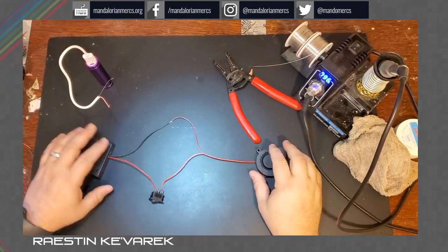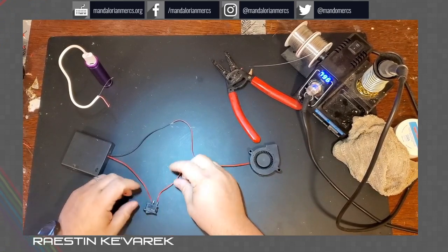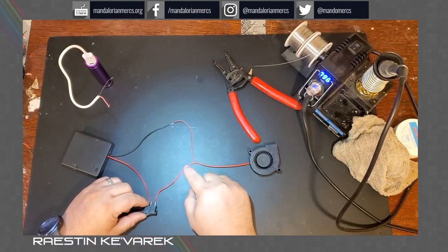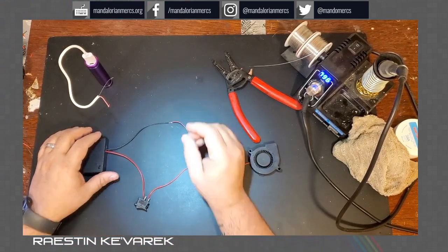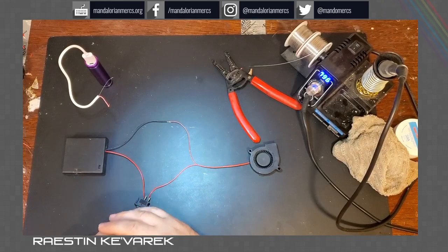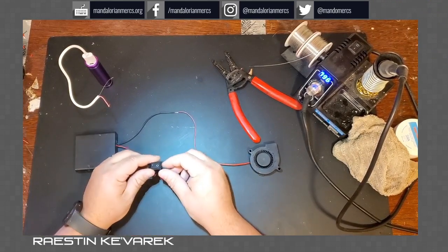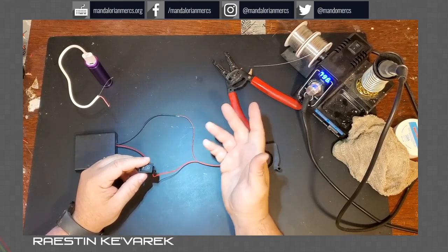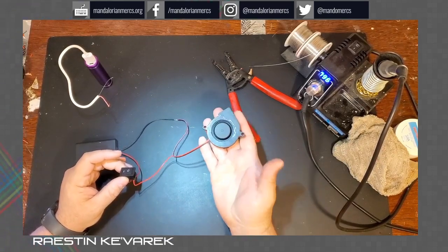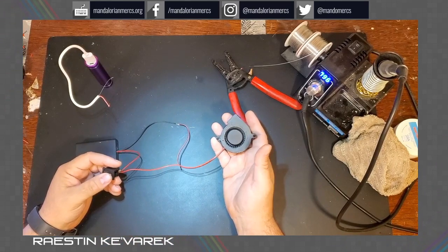We're back. I have the switch wired up in between the power supply and the fan. You can see it's very simple — we just have the power supply coming into the middle prong right here, the other wire goes into the fan, and our ground is soldered together. In this case, I didn't do any tape or heat shrink tubing — I just wanted you to be able to see the connections and how they work. This AA battery pack does have an on-off switch, but for the sake of the tutorial, I wanted to show you how to wire up one of these toggle switches. Now that everything's wired up and we have batteries in the battery pack, it's as simple as flipping the switch. There you go — it's blowing great. That's all there is to it.